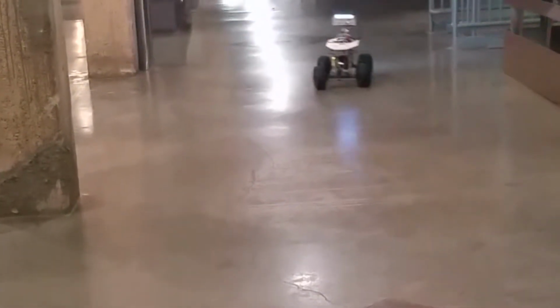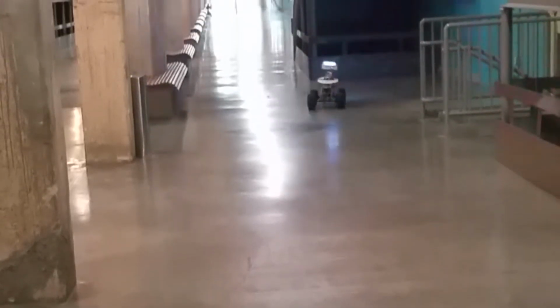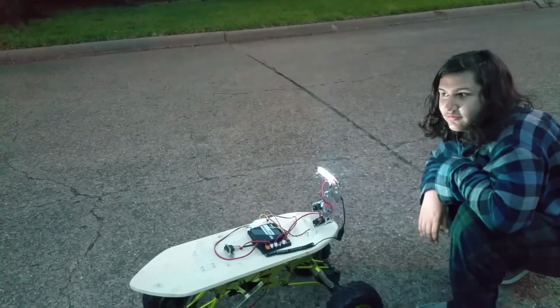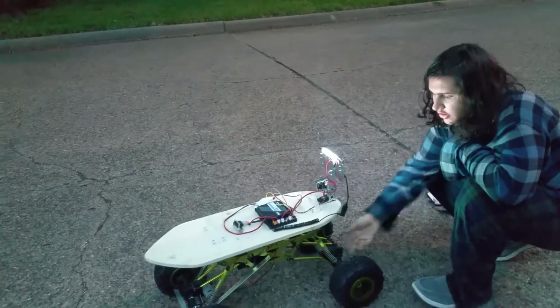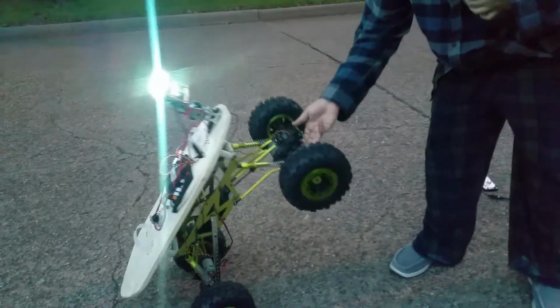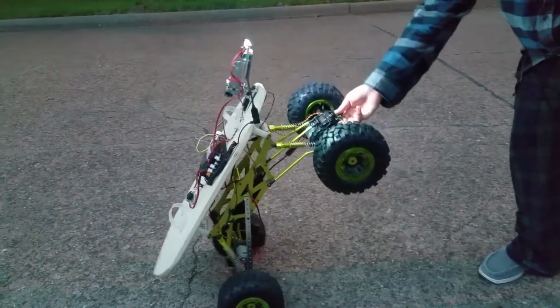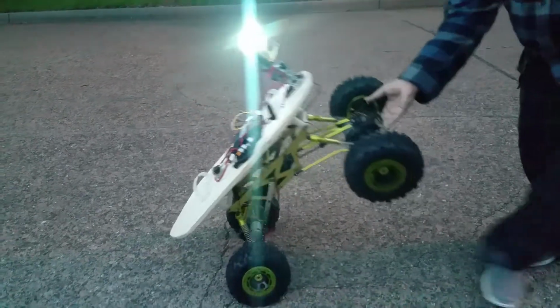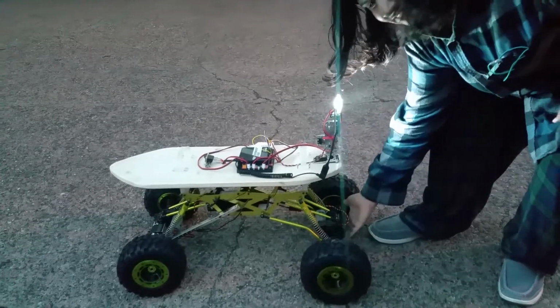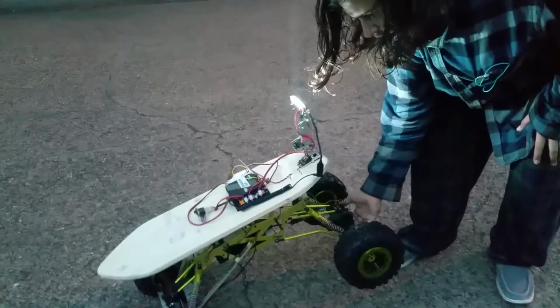We were happy to discover that REV decided to include a Bosch BNO055 based IMU on board. This is the same IMU we used for the last 2 seasons, and it is super accurate. Normally we use it for autonomous navigation, but now we're starting to get Argos to balance on its rear wheels using this IMU. It automatically transitions into balance mode when it detects that it has raised past the balance point.